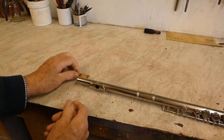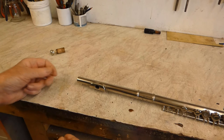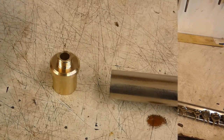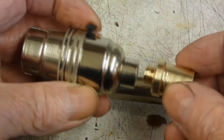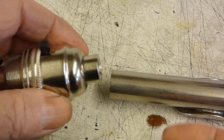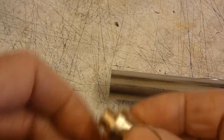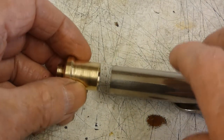However, that's going to be the first job — to make a piece to go in there which will have the same thread on as the last one, and screw in the bulb holder. This is the adapter to screw into the bulb holder. This time I got a silver one to match the colour of the flute, but the hole in there is smaller, but it still uses the old 26 TPI. Good job I still had the dies for the job.